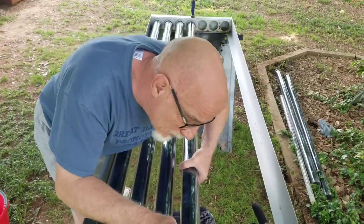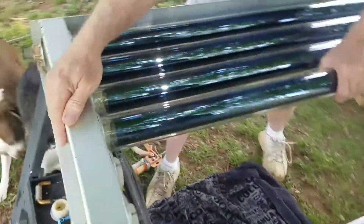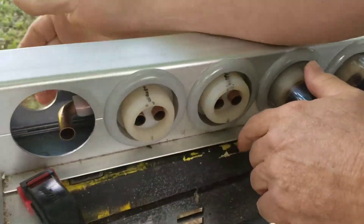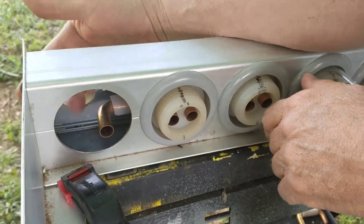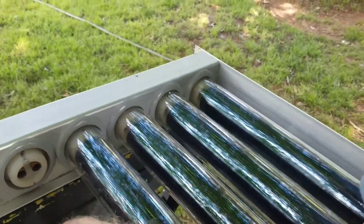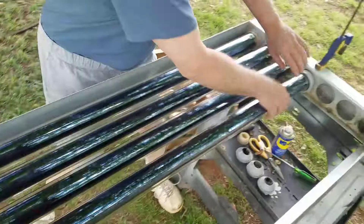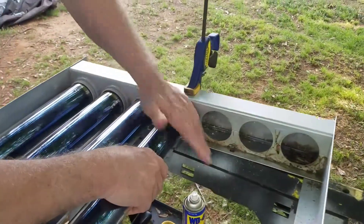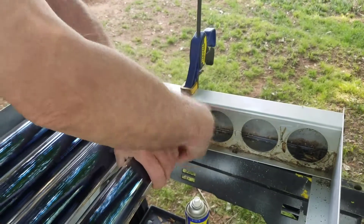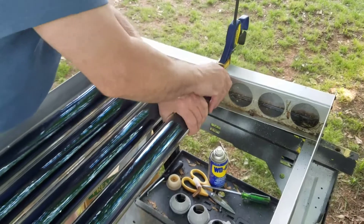These proprietary manifolds are really close together. It's kind of a circuit — it's an open loop at the top, and the water just keeps coming through here, follows to the next one, to the next one, to the next one. With three banks like this, you end up with about 40 gallons of hot water transferred through a heat exchanger in the basement.